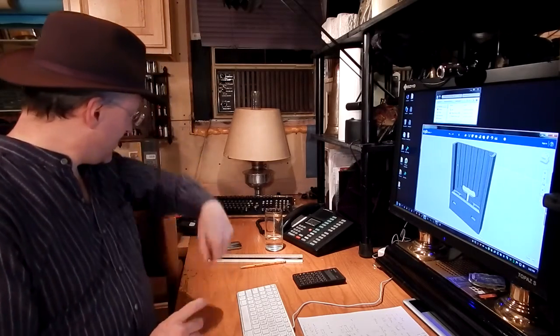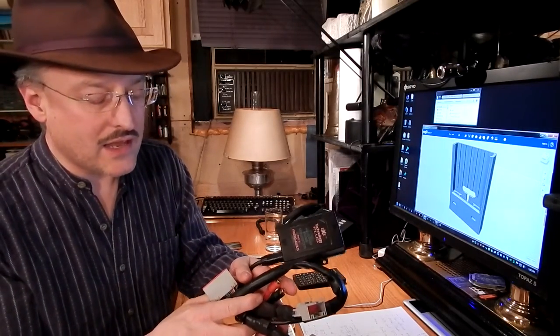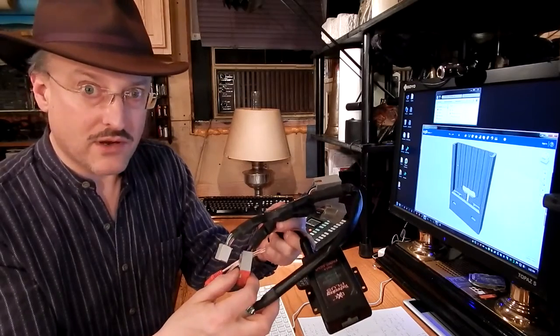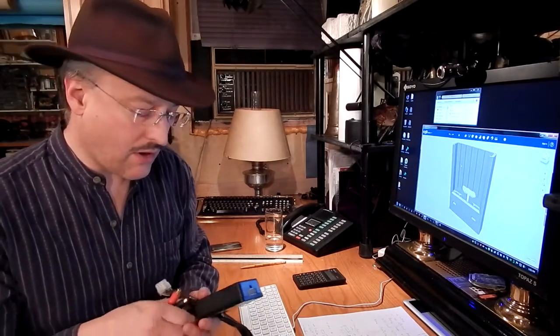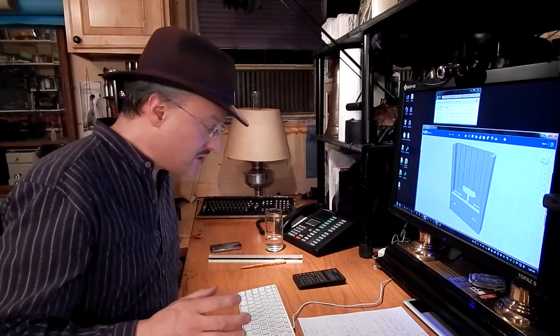because I figured I could hack something into this. So I did a little research, and I discovered a company that made this product. Now this radio has a satellite radio ready port on the back, and this product has a harness that plugs into that port and then plugs into the harness on the car, and a converter that takes the output from that satellite radio and puts it on a couple of RCA plugs. Unfortunately, apparently the style of radio in my car changed mid-year, and the particular one that I have is not compatible with this device, so I was not able to use that.